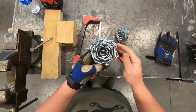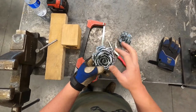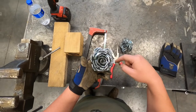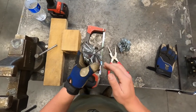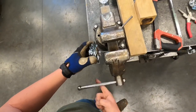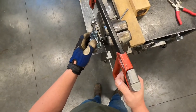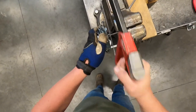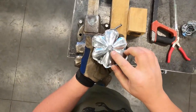All right, I've got it all shaped up. In the time lapse, every now and then I had to shift layers just so that it looked right to the eye. That's why we have just five petals — it keeps it all random with an odd number. If we have even numbers, like six or four, it ends up looking more like a pine cone than a rose. Next step: make sure that nut is as tight as you can get it, then we're going to cut off the bolt right at the base. We'll use our hacksaw, clamping the rose in the vise with the rose head off to the left-hand side, cutting as close to that nut as possible.